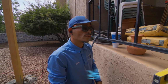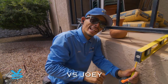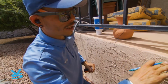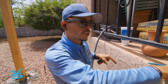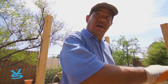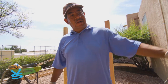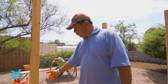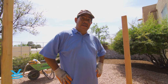For our decking, we need to frame it. So our original frame is going to be an inch below because the decking is going to be an inch thick. I'm burning an inch on this, so we put our frame right here. Once the inch is right there, the decking will fit flush with this, so that way it can keep on going all the way straight. We're gonna put a 2x6 there. That's what he's trying to tell you. Long 2x6 all around, all along that. And we're gonna bolt it into the concrete. And then we're gonna come off this way. We'll put another 2x6 on this side of these pylons. And then we'll put brackets, and that's how we'll get our frame. Very good, Jorge. Enough.